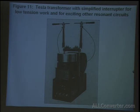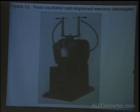In order to make and break the circuits, normally the container was spinning. It had mercury against its wall. This was one leg of the circuit, or one of the tungsten contacts, to compare it with something mechanical. The other end was normally in the center where all of the mercury was away from due to the rotation. And normally you had to have some type of insulator to place a rod through which would remain stationary, so that you could still make contact with the internal parts of this can while it was spinning.